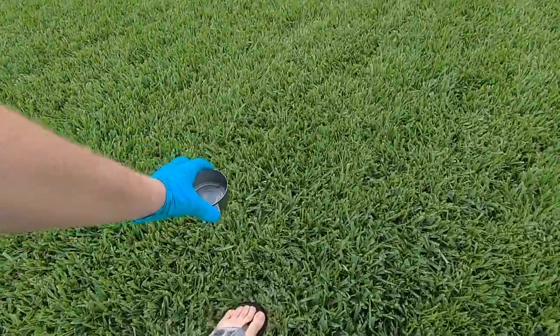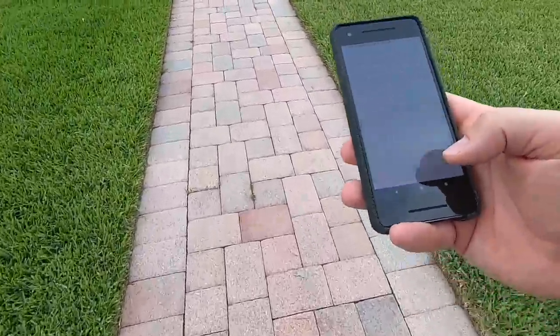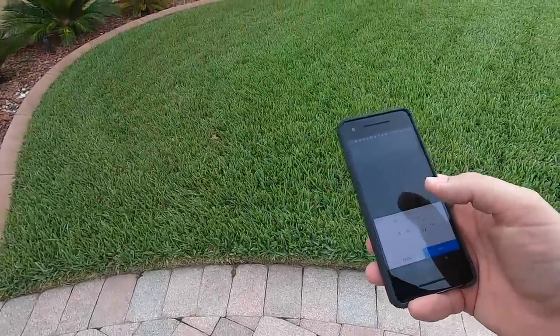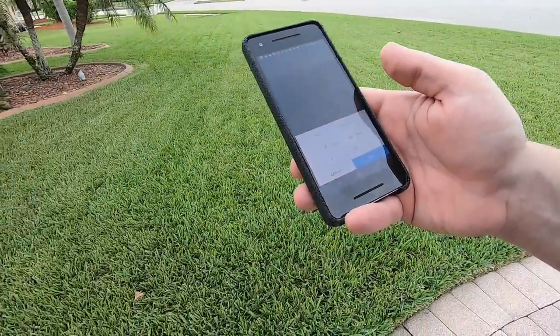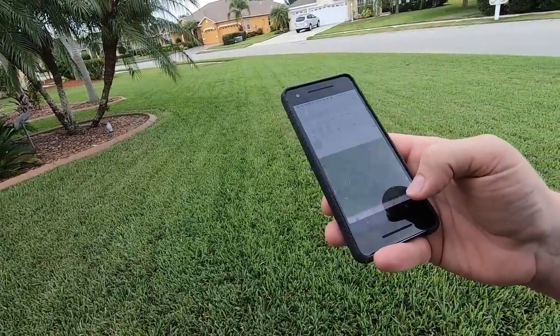But the idea being, get a good sampling of how long that zone is going to take to lay down 1/2 inch of water, and then record it, then move on to the next zone. You're allowed 1 beer per zone. So we're going to set it for 30 minutes. I know it doesn't take that long, and hopefully yours doesn't either. But either way, I'm going to set it for 30 just to make sure that we're good. And I'm going to run it.